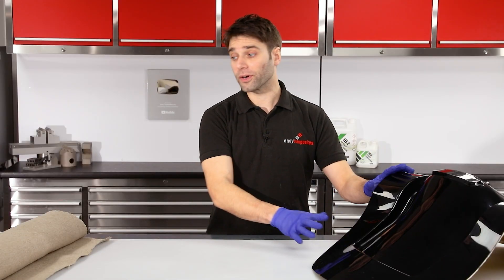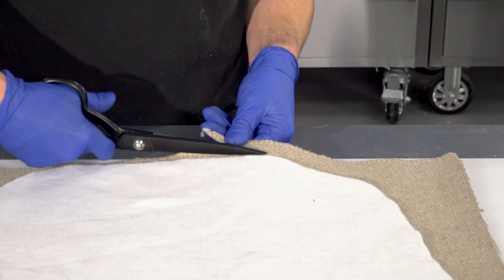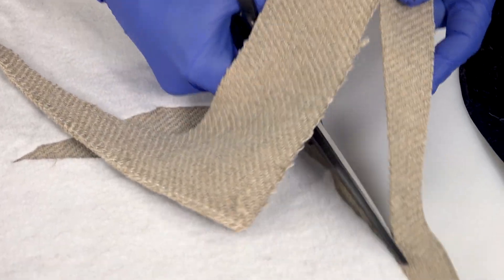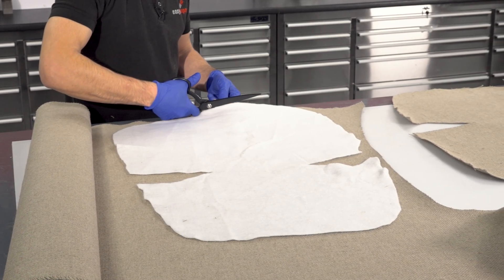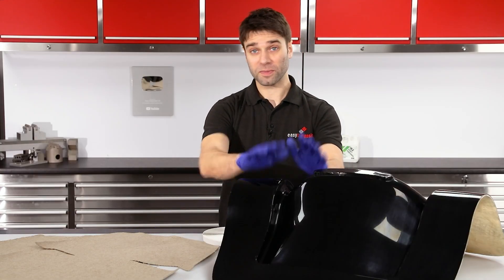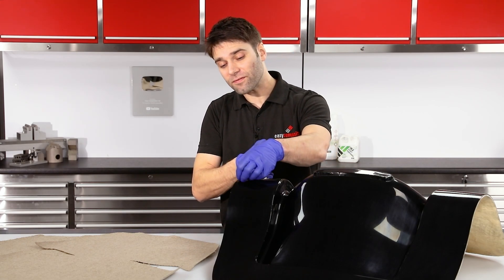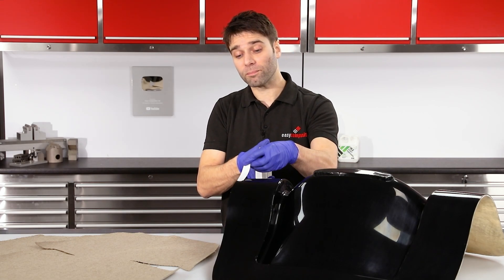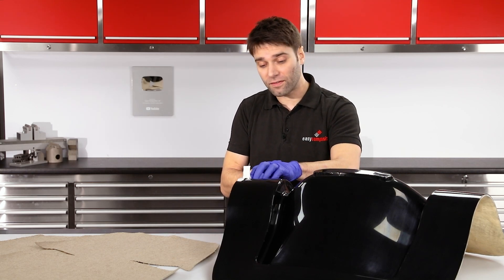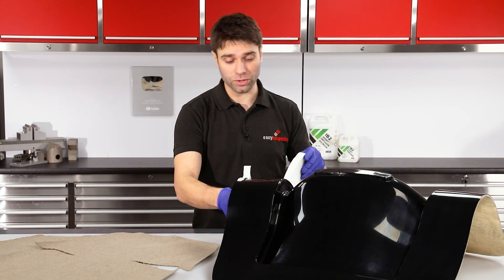While the release agent is curing off on the mould we can cut our reinforcement. Flax cuts like any other fabric and doesn't require specialist tools, so I'm just using a good quality pair of shears and cutting around a template made from an offcut of breather. Before laying the reinforcement into the mould I like to put the sealant tape on at this stage, because at this point I know the mould flanges are completely clean — later there's a risk that fibres could get underneath the seal and compromise it.